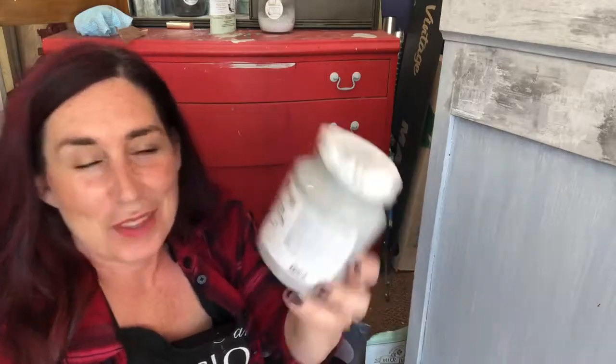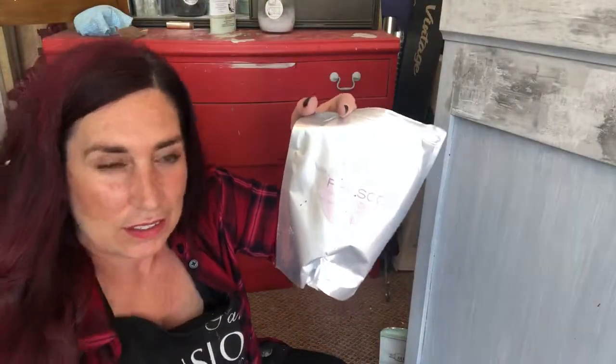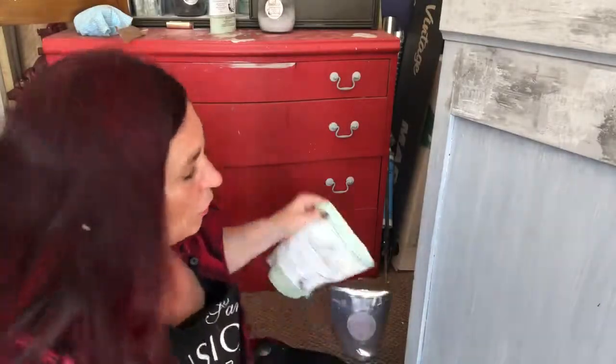So this is the plastered polished plaster finish. For the base I've used Little Lamb, and to Little Lamb I've added lots of Fresco, kept stirring it and made it into a thick mixture. For the lighter variant I've added white — I used Farmers White milk paint powder and I just didn't mix it all the way. I left some sprinkles in because I wanted some nice pigment streaks coming through.